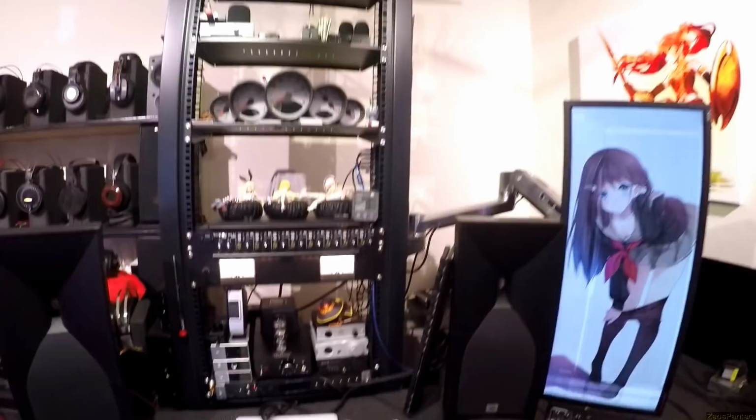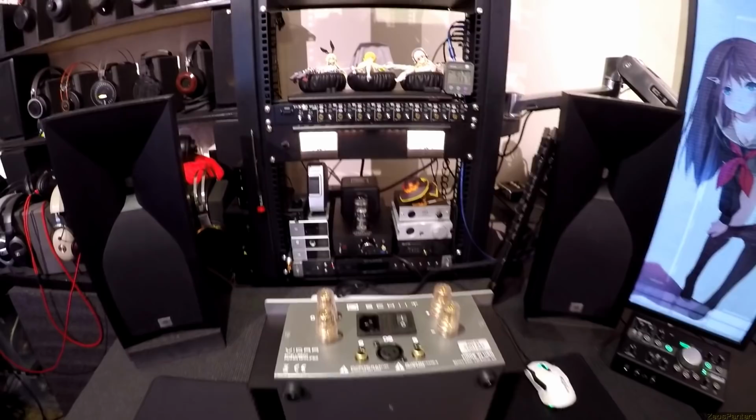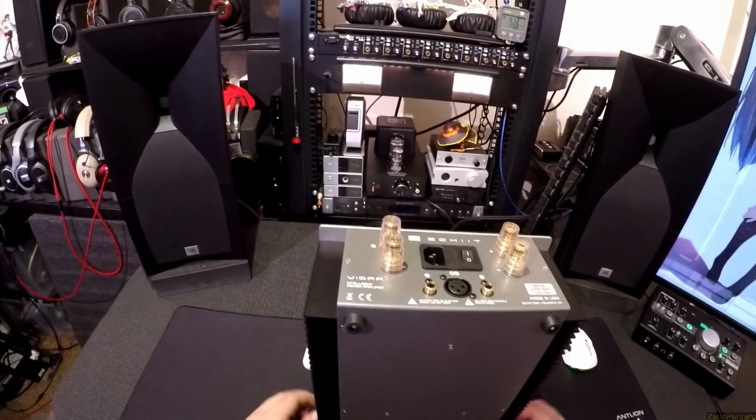The highest I saw it draw, by the way, I should probably tell you that, and that was on this desk with these speakers, was like 85 watts, which if you take out the 15.3 watts that this is drawing currently, means you're drawing 70 watts. So I don't know how you get 700 watts drawn out of this, but there's a possibility, so keep that in mind.